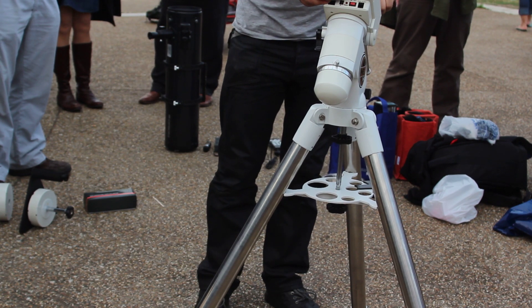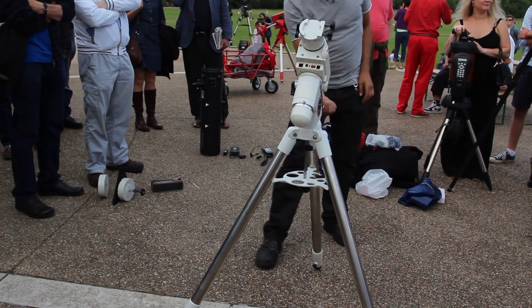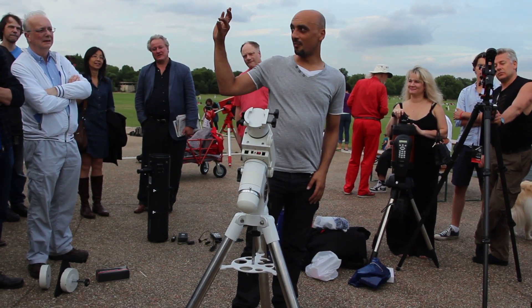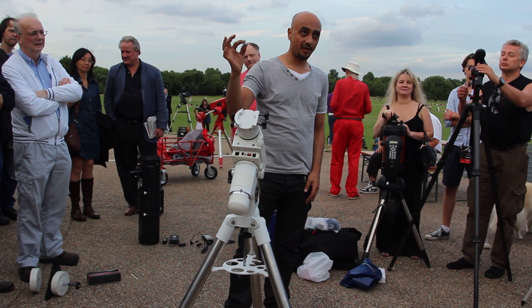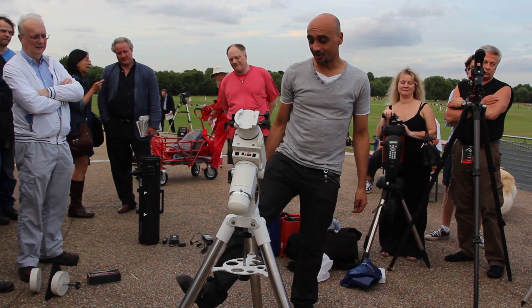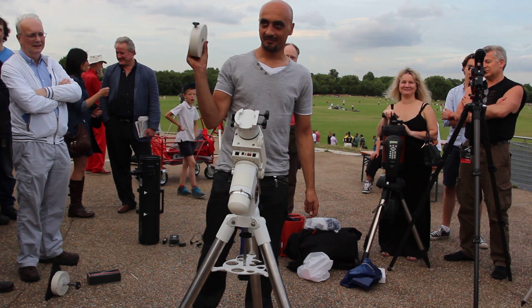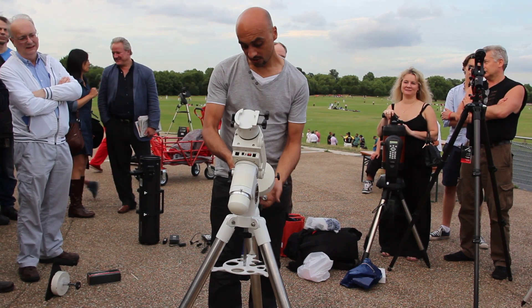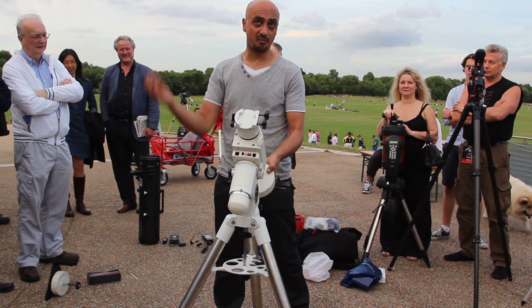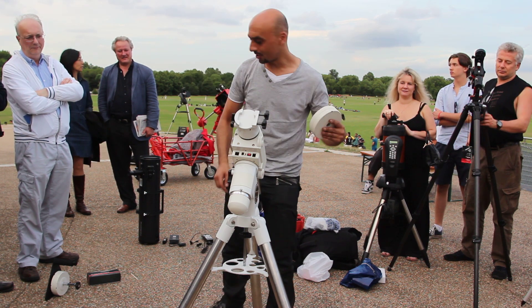Next is the counterweight shaft. On this one it's retractable; on other smaller ones it screws in. On the bottom there's a restraining bolt — this is pretty important because I've nearly lost toes because of this. Always use the restraining bolt. The amount of times I've been lax and a weight has slid off — this is why I wear steel toe caps. You don't want five kilograms dropping on your foot. Whenever a weight goes on, secure it. Even if you're just bending over to pick up the next one, it's always good practice to put it back on just in case. You might not tighten it up correctly. You don't want to squash toes.